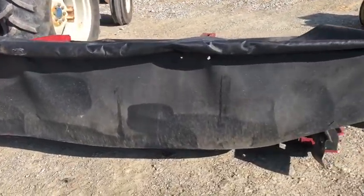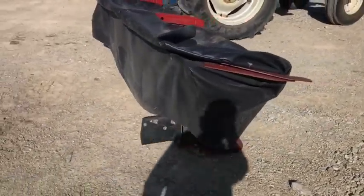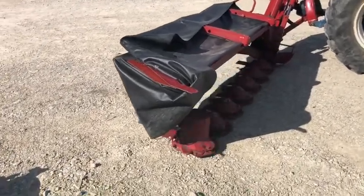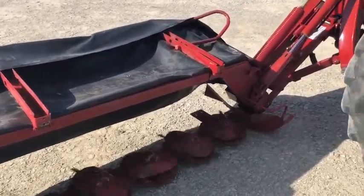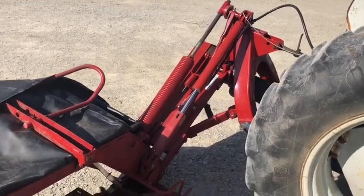There you can see the canvas is like new on it. This is a modular cutter bar, so each turtle basically has its own little gearbox, just like the New Holland's. We have gone through and checked the oil in all of those and also in the main gearbox. Lots of paint left on the turtles — in fact there's hardly any wore off at all. Very low acres. The A-frame's all intact.